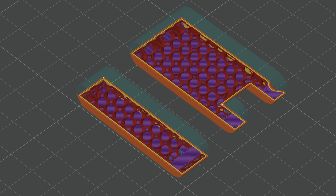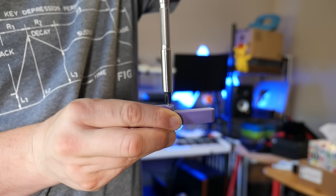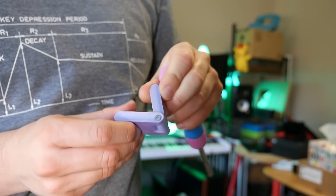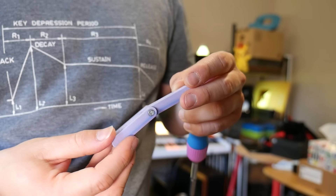Because the parts are printed separately, you don't really have to worry about them welding during the printing process, and a metal screw will easily outlast the print in terms of durability. I use this style of hinge all the time because it's simple, robust, and precise, plus the two sides can be separated again if required. However, by using a metal screw, it means you need to have one that's the right size, and if you digitally distribute your design online for other people to print all around the world, they'll have to find the same screw too, which isn't always that convenient.